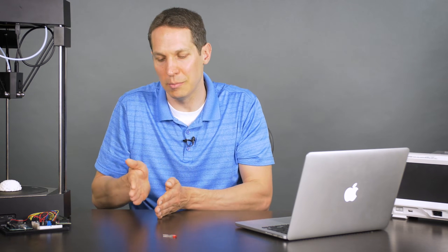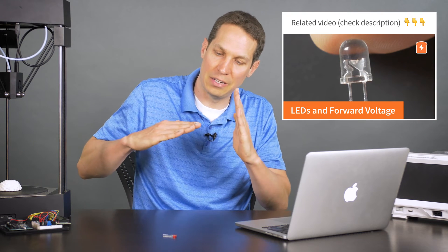So if you can very finely control the voltage, then you don't need a resistor — you can say 1.7 volts, good to go, 1.8 volts, good to go, and know you'll never exceed that. But by the time you get up to two volts, the current spikes and causes damage. You stick a resistor in there and once you get over that forward voltage, you have a semi-constant voltage drop over the LED. The resistor gives you a linear relationship between voltage and current, acting as a protection device so the current stays reasonable.